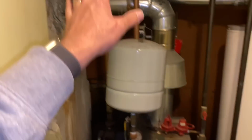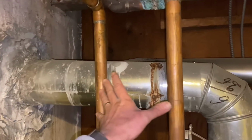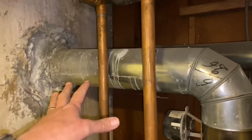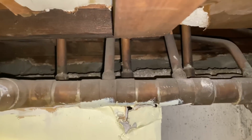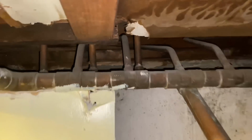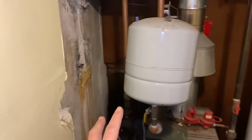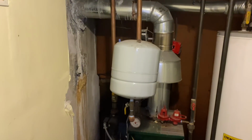Most important, we have this boiler. We have 1.25 inch supply and return lines. It is very important that we maintain direction of flow. The reason for that are those T's right there. See those T's? One pair contain one monoflow T, right? And if we reverse orientation of the system, the cones that are inside there to divert water up to the T, well, that won't work anymore.